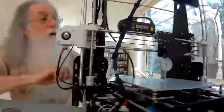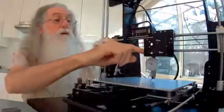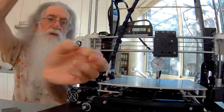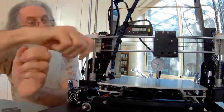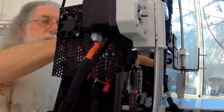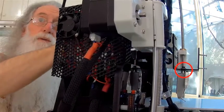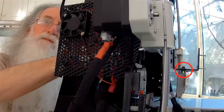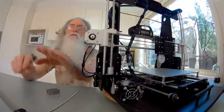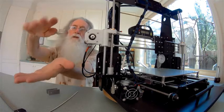So you've done that. Now on the inside, these type here have a little dovetail on them and the screw; the dovetail fits over the slide, and then the screw comes in and locks against the bottom, so that locks it in position. Now the good thing with this one is that it happens to be M4, so you get yourself an M4 screw or all thread, whatever, and you just screw it through. I've got two washers and my one just happens to fit, but you just put a nut above and below, and on the cutout where the nozzle goes you just have a washer, the cutout, another washer, a nut on the bottom, nut on the top.